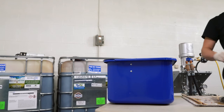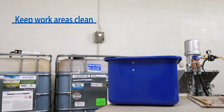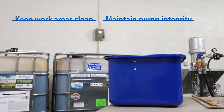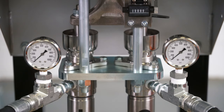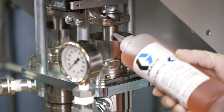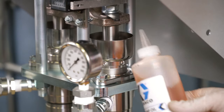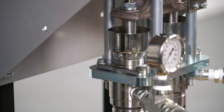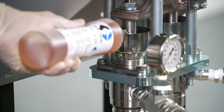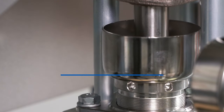Proper maintenance is the key to long equipment life, reliability, and efficiency. Flat proofing does not have to be a messy procedure as long as your work areas are kept clean and the pump is in good working order. On initial setup or after cylinder replacement, the wet cup should be filled one-quarter of the way with throat seal lubricant. This oil provides critical lubrication to the piston rods and helps seal the Teflon packings. With normal use, the TSL oil in the wet cup will change color as the flat proofing material penetrates the seals. This is normal.